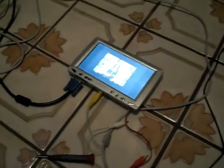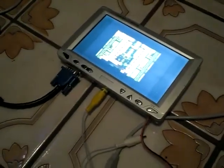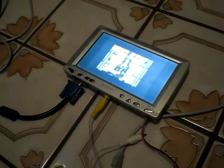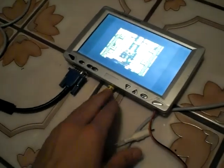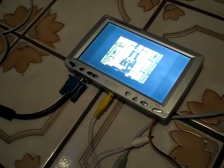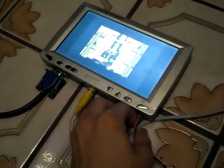It doesn't have a lot of applications, but for my specific application I'm pretty happy with it. This is a video decoder — not to be confused with a video encoder, which takes RGB and makes composite or S-Video. This actually takes composite and S-Video and converts it to analog RGB, a much more complicated thing to achieve, and not an easy circuit to build from scratch, which is why I've repurposed a car 7-inch LCD monitor here.